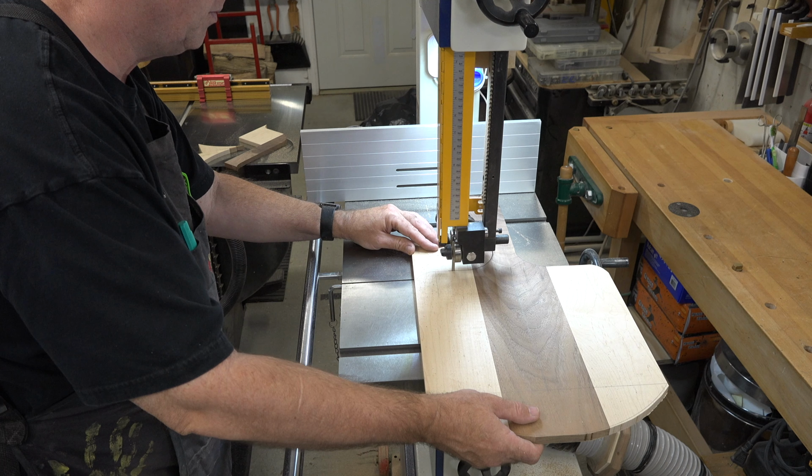Well, we came in here at 5 11/16. Now we're going to come in at 3 11/16 from the edge, from both edges. And as well, we came 14 inches up to the top of our line. We're going to place a mark here at 16 inches up. And guys, this will be our center point to draw a 2-inch radius for the transition between our handle and our body. And we can set our compass at that radius and just draw that transition in place.